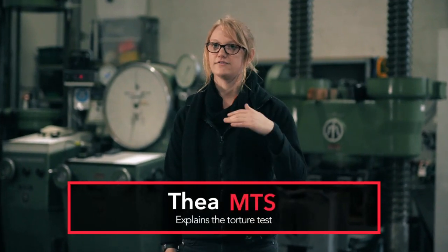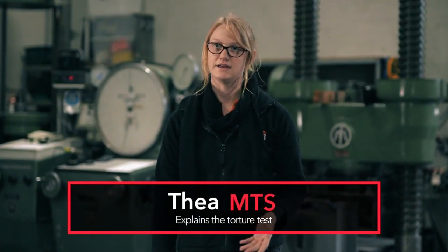So we lifted a 50 kilogram mass up 5 meters and then back down again repeatedly. So essentially it's a fatigue test, and we're looking for either a circuit breaker to trip or the motor will stall.